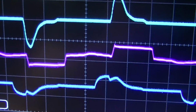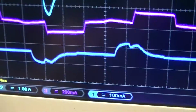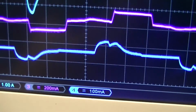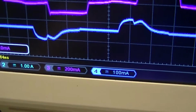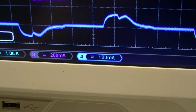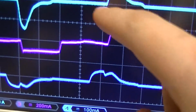I think the nominal operating current of this lamp is somewhere in the neighborhood of 600, 700 milliamperes or so. So I can say again, fairly high. Crest factor probably 2.5 to 3, which is typical from what I've seen. 192, 200 milliamperes. There you go. Okay, this, again, is as a reference, that's what I'm triggering off of.